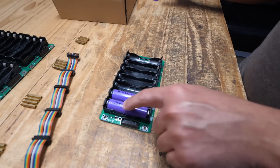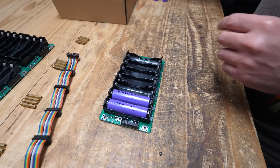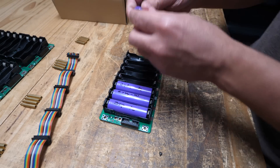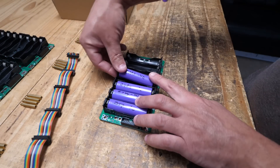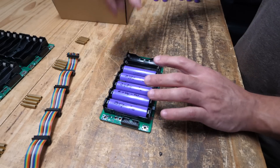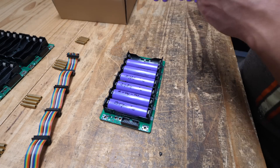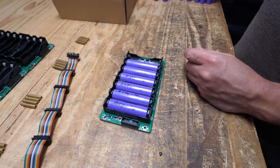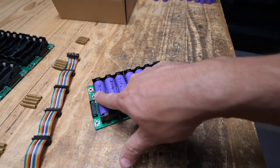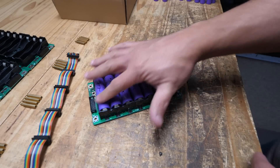For example, this one is 2900 milliamp-hours and these two I put in are around 2750. Reading capacities: 2847, 2782 — that's fine. 2860, 2901 — some are coming out pretty good. 2850, 2787. Then 2650 — that's a bit small. 2841, 2750, 2719. More: 2650, 2650, 2638, 2828, 2833, 2827, 2818, 2827. There we go — first board done, all around 2750 within 20 to 30 milliamp-hour difference. That's a well-matched board.